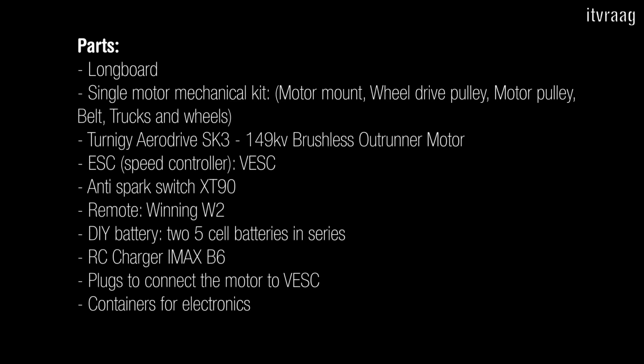Here's a full list of all the parts I have used, also in the description. I used the longboard without the trucks and the wheels, because those are included with the single motor mechanical kit, which also includes motor mount, wheel drive pulley, motor pulley and belt. For the belt, I would suggest to order a few extra, because you'll need to replace it periodically.